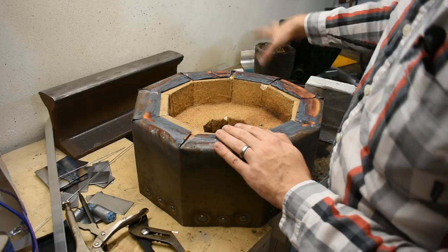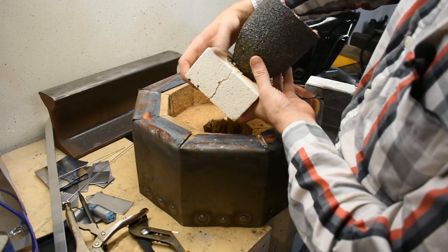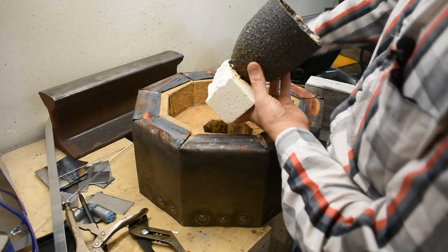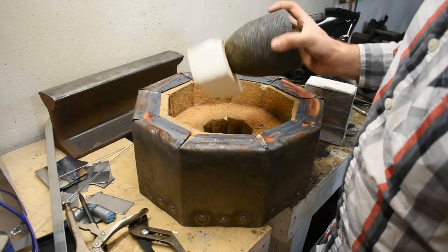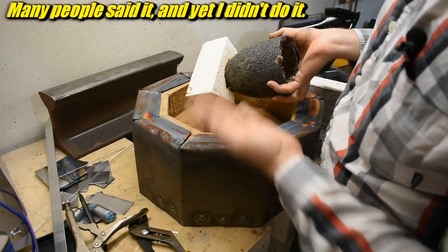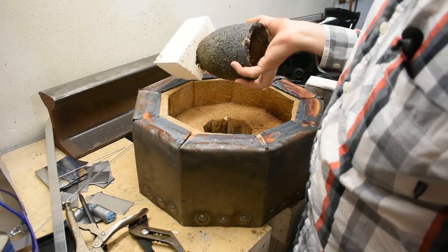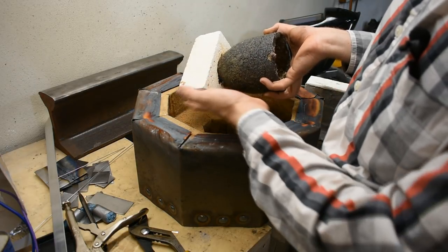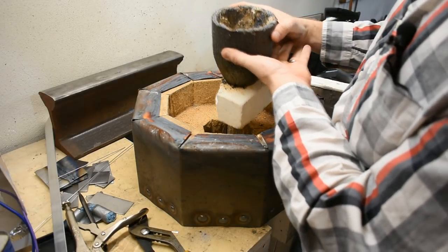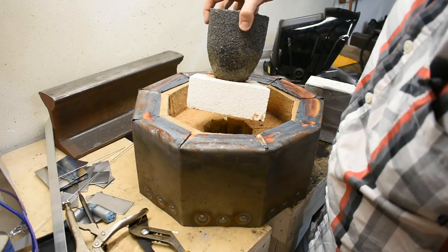I know satanite is good at protecting the bricks because my plinth brick was not protected and it cracked. This is another 2800 degree firebrick offcut. There was no force or nothing - it just kind of had a crack forming and it got bigger and bigger, and then eventually it just broke apart. Also, it's stuck - stuck to the crucible. Quick tip: some people say put a piece of cardboard on top of your plinth brick, and then when you fire and burn the thing, it'll leave a coating of ash carbon that'll prevent this bonding from happening. This has happened a few times and I just stick it back in, and when it gets good and hot it comes off again. This is either vitrification or potentially borax - I used to use borax as a flux a lot on this, and the crucible looks like death. I've since been told that might not be a great idea.